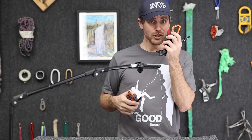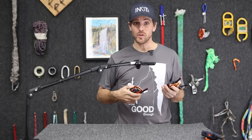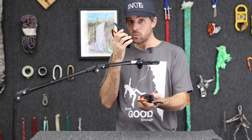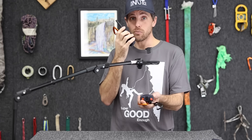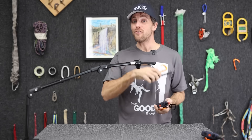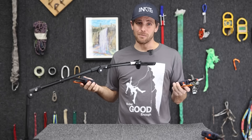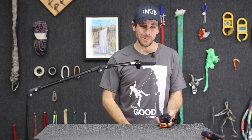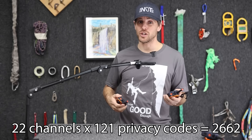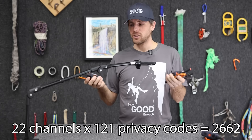So the first half of the privacy codes send an analog squelch tone, and the second half send a digital code. If you start on channel one and the privacy codes are off, you are going to pick up every signal regardless of their privacy codes that share that frequency. So you really need to know: it's not a privacy code, it is a leave-me-alone code. Everyone can hear you that's on that frequency, but you don't have to hear everyone when you're on El Capitan and want to just be left alone. When I was on El Cap going from channel one, two, three, four and had problems all the way up, I gave up by the time I got to channel 23, which is when I would have started having less problems. So there are 22 channels and 121 privacy codes, giving you a total of 2,662 usable separate stations.